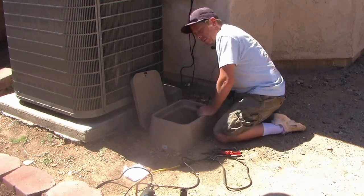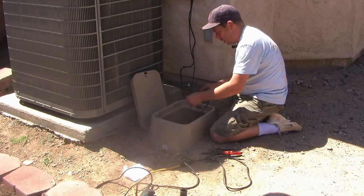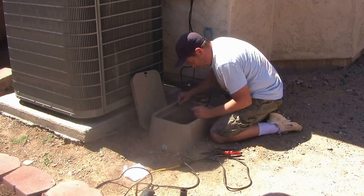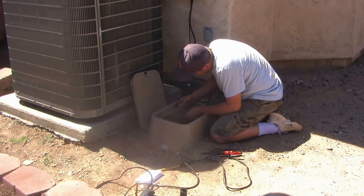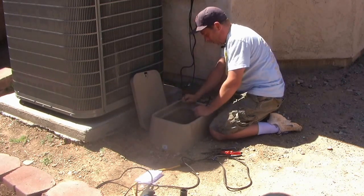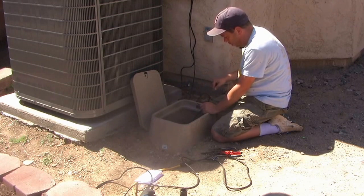Now things are a little tiny bit different down here. Each one of these valves has that black solenoid that we saw before with a pigtail coming off of it. And it shouldn't matter which side you wire it up to. I'm just double checking these ones to make sure that they are not specific. Nope. Okay, so one wire will go to your common ground, your black. The other wire will go to one of the colors.